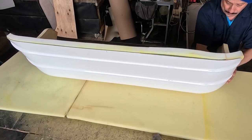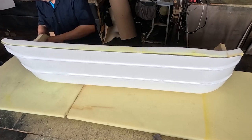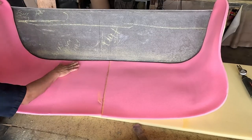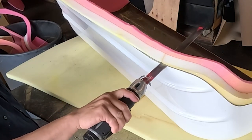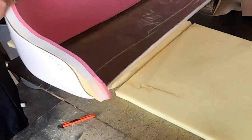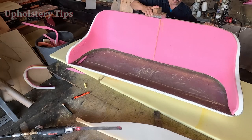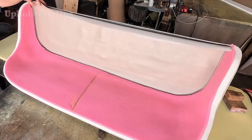I get the half inch and do the same thing. I put glue already — I didn't show you that part, I thought it was not necessary since you saw me putting glue on the one-inch thickness. Then you just see me layering the other half inch on top, staying with glue and then cutting around that edge. I cut it around — see, I got the backrest. In case you didn't cut it straight, you can get a sander and sand it right here.